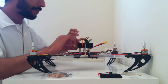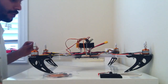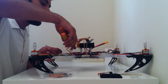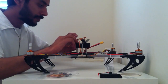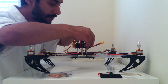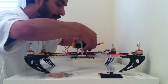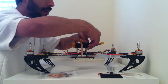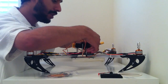We want to make sure the radio receiver is fairly secure. Once we have our radio receiver firmly installed, we can go ahead and place our KK board inside the storage case. You always want to apply pressure to the corners where the slots are installed and not directly on the soldering points on the board itself, because you can easily damage the board.